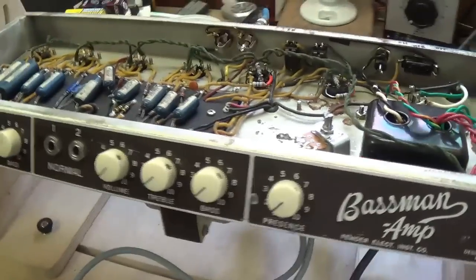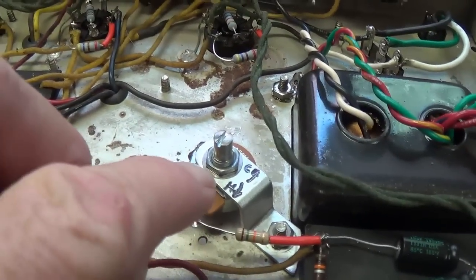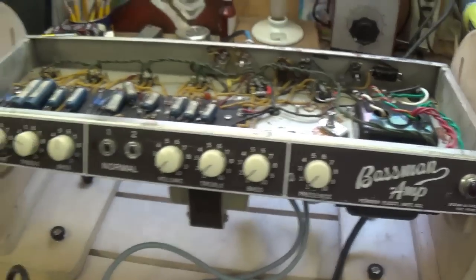Okay, we have plugged into the AC wall outlet so that our amp is receiving full 120 volts and proper current, and we have our tubes biased at about 20 to 21 watts of plate dissipation, which is at 70% of max. So let's get started.